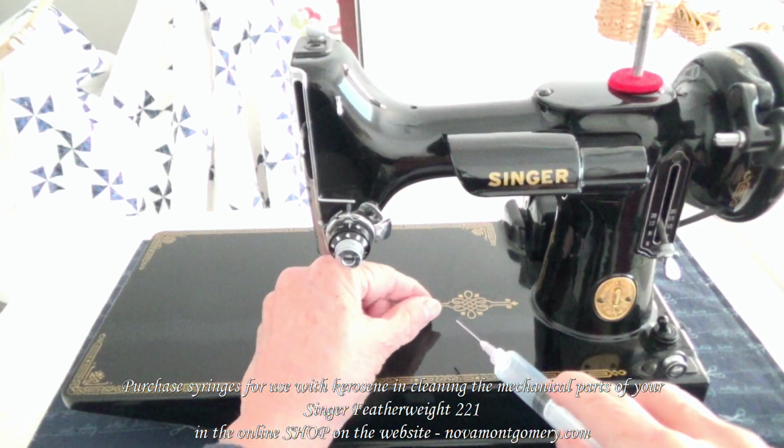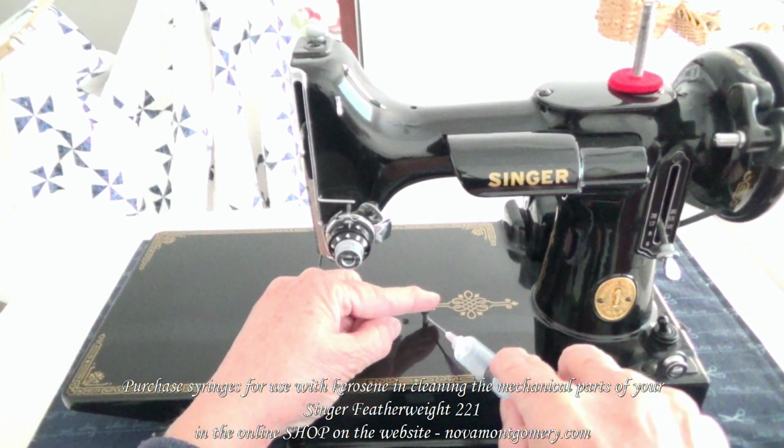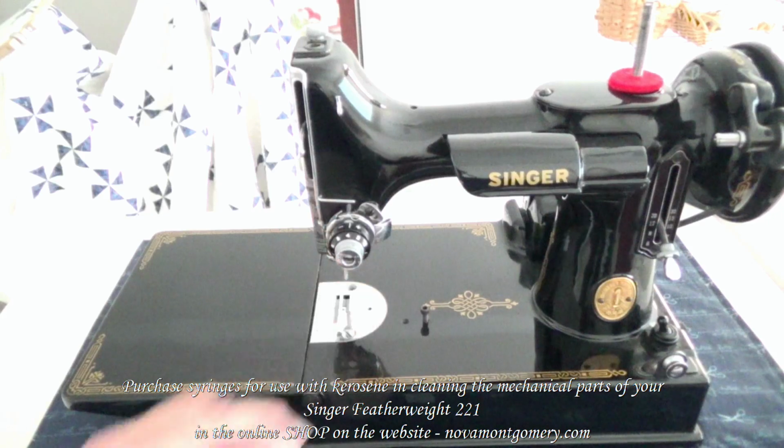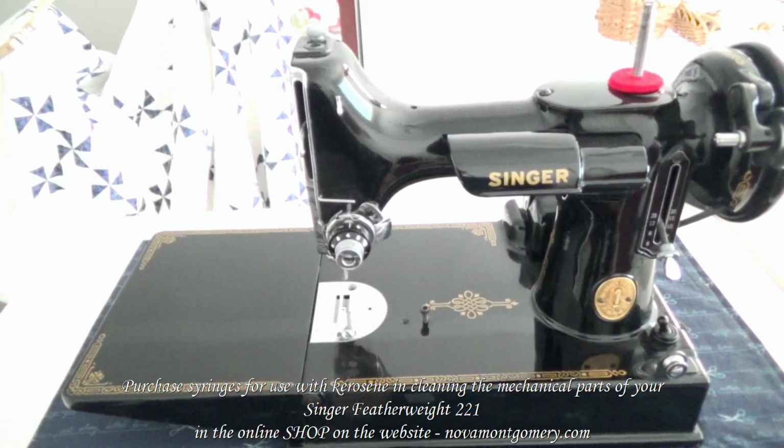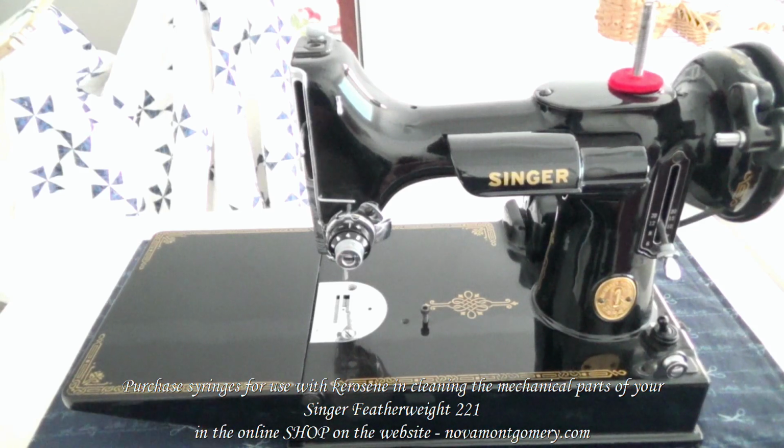Whoop, back it out first. I forgot to back it out. There we go, back it out. Put a drop of kerosene. And you're going to continue in this manner, snugging it down, backing it out, and putting another drop of kerosene until you've worked it all the way down.